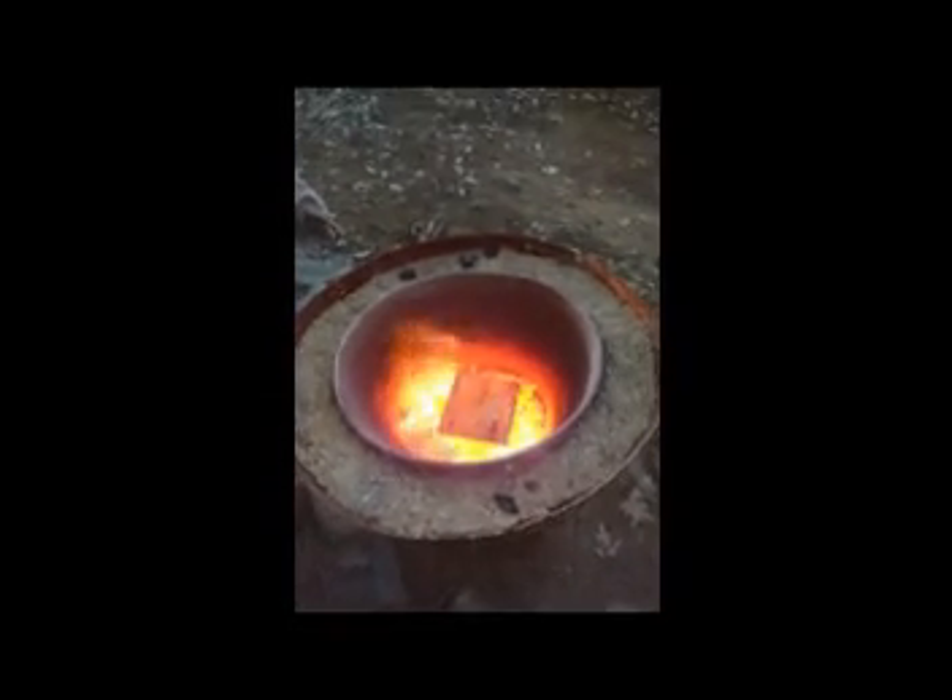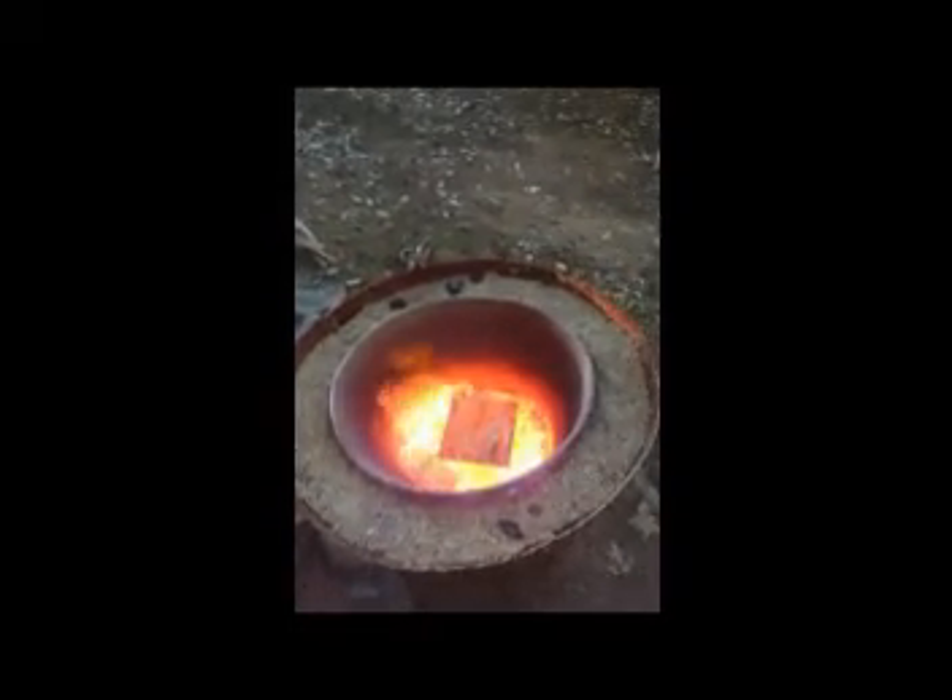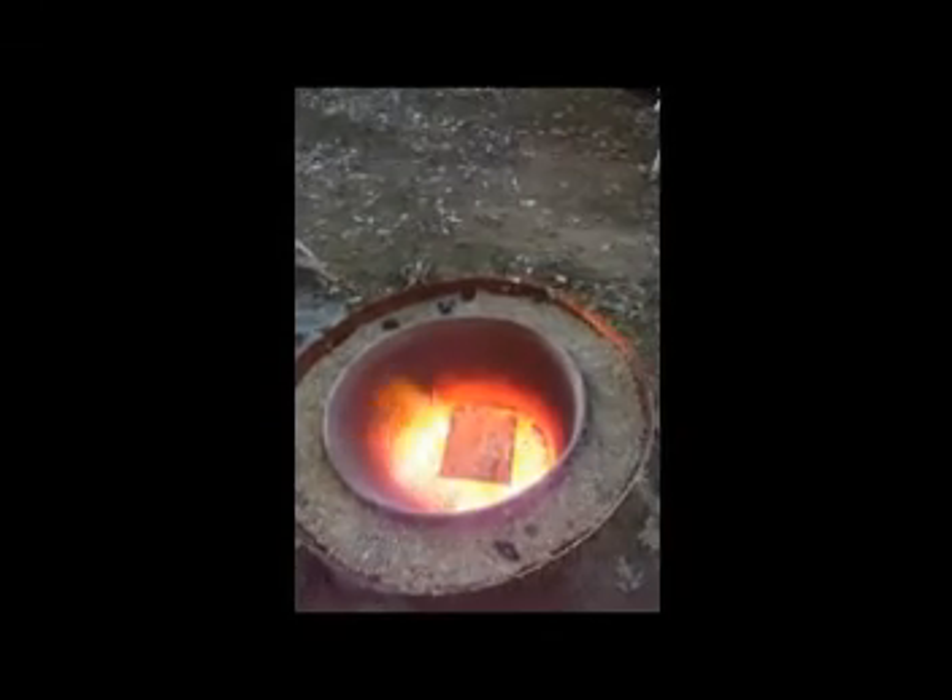You can see my crucible stand is red hot — we definitely exceeded 1,100 degrees to melt that aluminum down. That's so great. My operation worked — here's my first pour. Got a success with my $0 furnace, rocket stove style. It's shutting down now on cool-down mode, but you can see the fire is still happening down there and my crucible's in there.